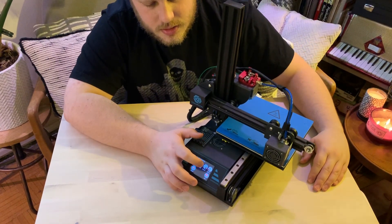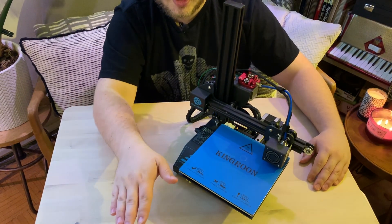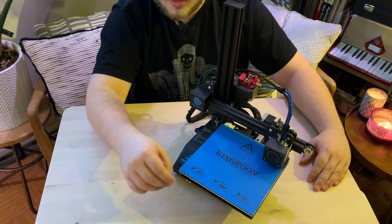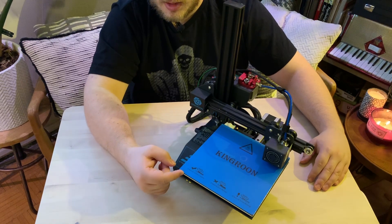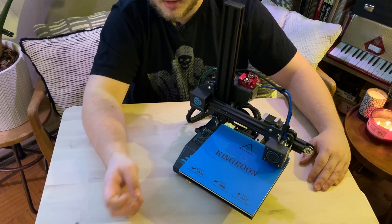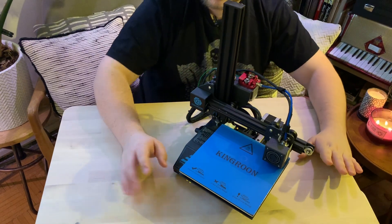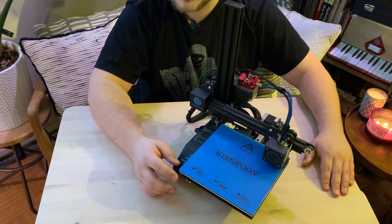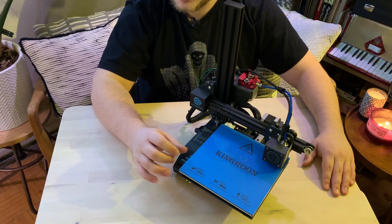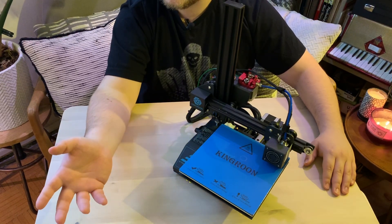One thing you want to make sure when you're doing this is that you have your print surface completely clean. You can run over it with a razor blade, just scrape everything off. Any melted little bits — on mine when it came out of the box, the corner where it homes was melted a little bit. You can run a razor blade over it and it'll usually smooth it out. Generally speaking, you're not going to be printing right up to the edge anyway, because the heated bed doesn't radiate fully across the whole surface — it has different hot spots. You want to avoid the outer edge because that's where the heat tends to be substantially lower.